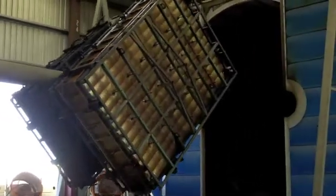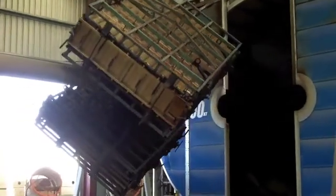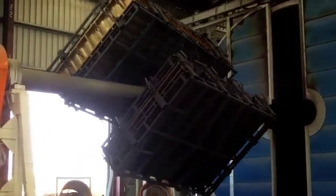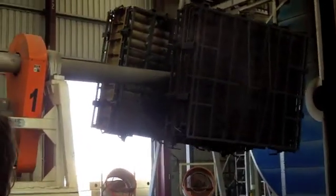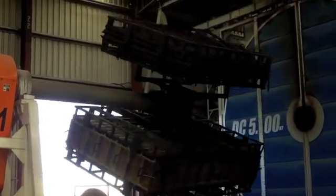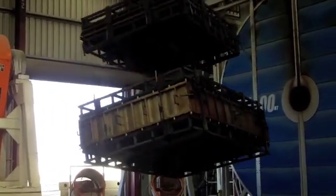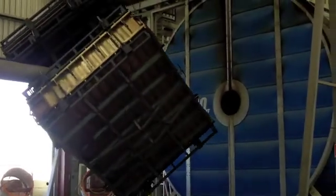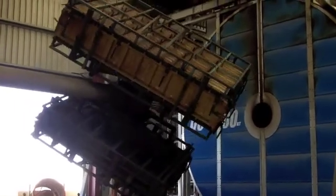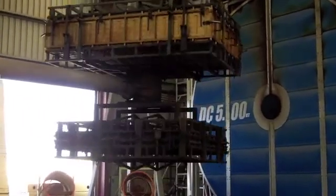Once removed from the oven, the Thin Tanks are then required to go through a cool-down process, which takes between 20 to 25 minutes in total. This part of the process is quite critical and cannot be rushed. This cool-down process is assisted by fans and a fine mist spray, which is directed at the outside of the mold as the tanks still spin on the large mechanical arm.